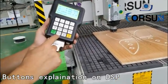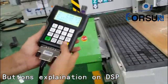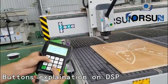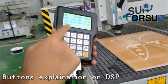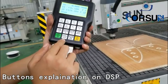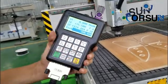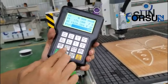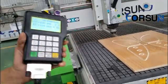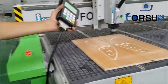Here is the mode. Press it — now the mode is continue, which means the machine moves continuously. Push again — step mode. Step means how many steps it will move. For example, we choose a step distance — now it is 300, we choose 200. When you push the axis button, it will move exactly 200mm per press.